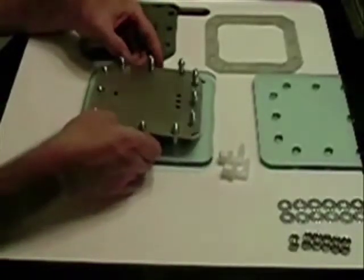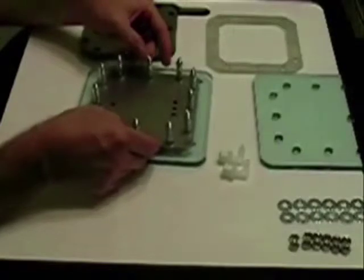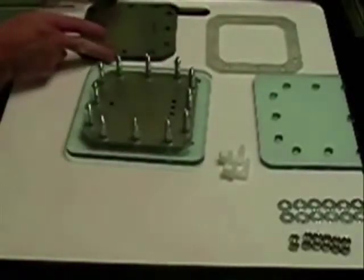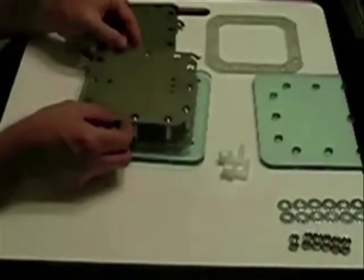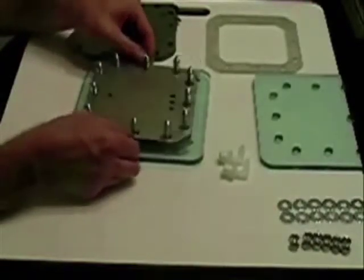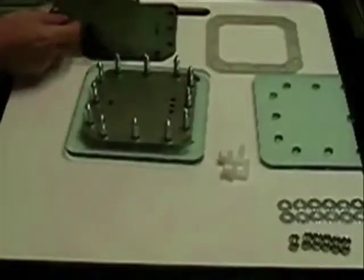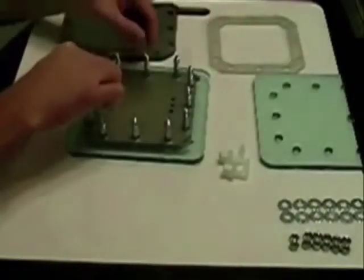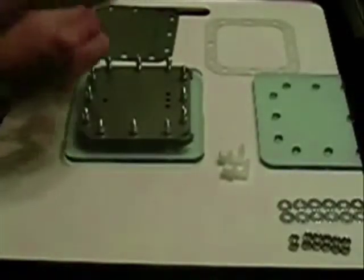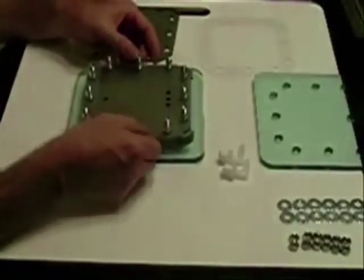Come back with a second plate, drop it down, go with another gasket, another plate — alternating every other plate. You could put all the connections on one side, but that would not give you enough room to make your electrical connections. We want to use 10 gauge wire so it won't get hot. Go with another gasket, another plate. I used 100 grit sandpaper — I actually put it in a jig sander and that made it a lot easier on my hands.